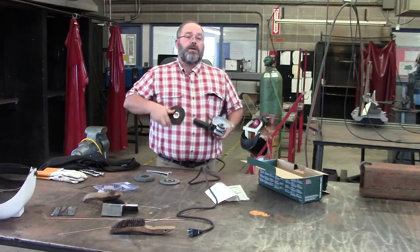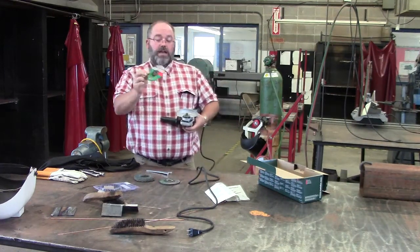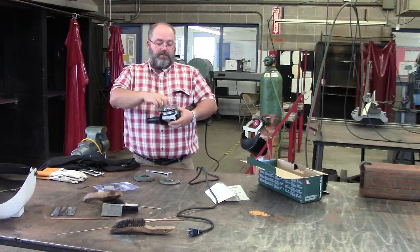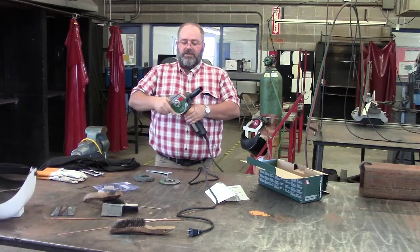This is a cutoff wheel. Each one of these wheels has its paper blotter and all the information that you need with it. A cutoff wheel is maybe for cutting material. Instead of grinding it, we're going to cut it. Put it on the same way, thin side down. Adjust your guard.